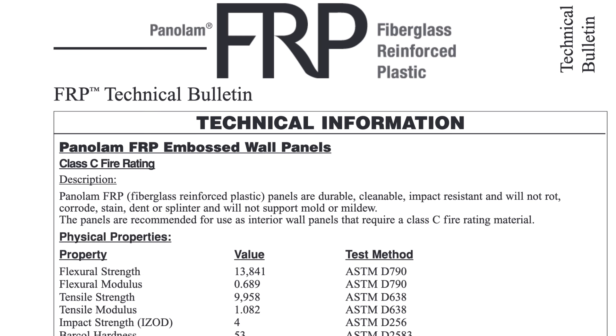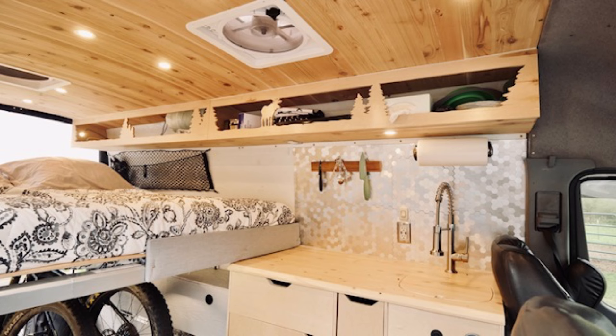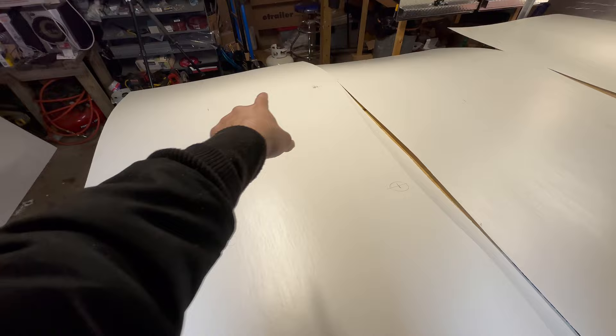For the ceiling I'm trying something new — FRP panels, which are fiberglass reinforced plastic panels. They're often used to finish interior walls in trailers and even used from the factory in certain campers. It's a good product for high moisture areas, though it typically needs to be glued to plywood since it won't offer much strength by itself. I don't love plywood for campers because it can delaminate with moisture. I typically like solid cedar tongue-and-groove, but for this build I wanted something that would allow easy future access to the wiring and could be removed if the future owner wants a different look.